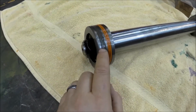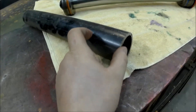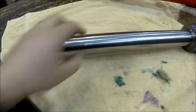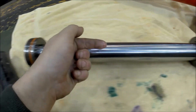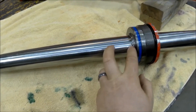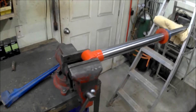What I'm going to do is take the nut off, take the piston off, and then take a piece of thick-walled pipe I found — probably about quarter inch wall with a two inch diameter. I'm going to cut off a two inch piece, bore the inside to maybe about 15 to 20 thousandths bigger than the rod, slide it on, and put the piston and nut back on. As the piston gets pushed all the way down, it will stop because the pipe will be hitting the end cap — that's how I can restrict the extension.